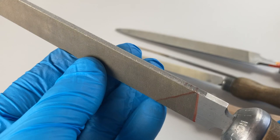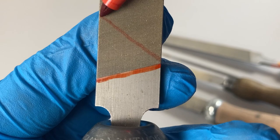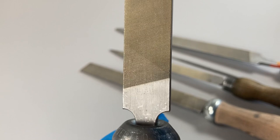All the files I'm using today are double cut. There's a primary cut at about 70 degrees from the edge of the file, and then a secondary cut at about 50 degrees from the edge. This double-cut system makes for smoother filing and prevents resonance, so the teeth can't as easily fall into the gap that the previous one has made. Most of the files we use are double-cut files.